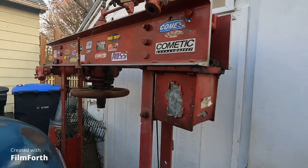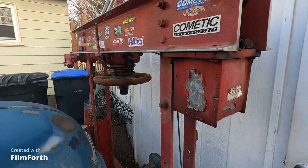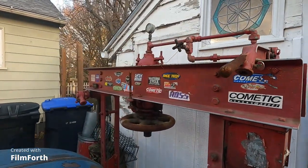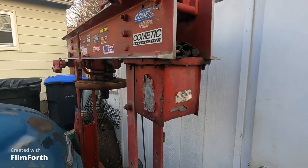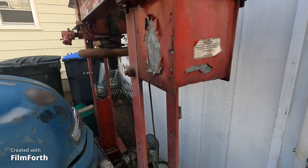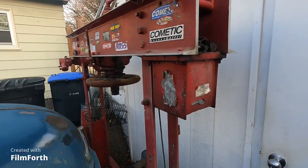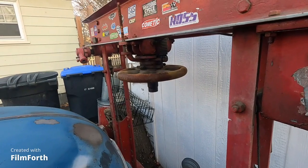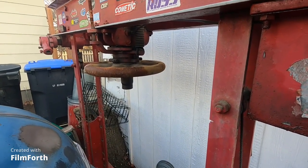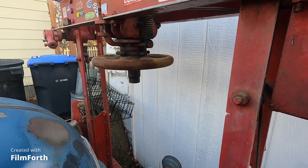This here is a World War II manly 50 or 60 ton press — I think it's a 50 ton, maybe 45 ton — but you can put a big cheater handle on this thing and squeeze 60 tons out of it. I got this press more than 30 years ago, and it's local — it's from the air base up here. I rebuilt a lot of dirt bike crankshafts and other types of multi-piece crankshafts, snowmobiles and stuff. There's a lot of pressure holding those things together, the crank pins into the other parts.